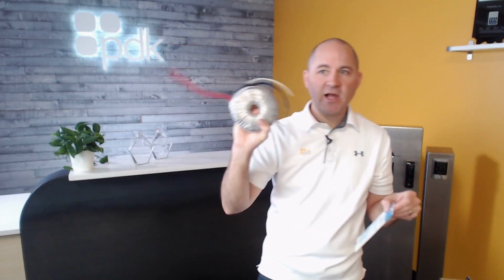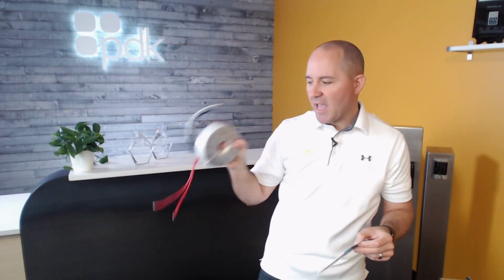It actually works very similar to a linear power supply, right? This linear power supply is just a bunch of copper wrapped around a coil, and it's burning that power off. So if you're running a long way with an under gauge wire, all you're doing is burning that off and causing issues and substantially more line loss at the end. So make sure that you reach out to ASSA ABLOY, get one of these calculators. There's hundreds, if not thousands, of calculators online that you can use as well. But this is nice just to have in the back pocket or front pocket, and be able to do those calculations.